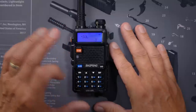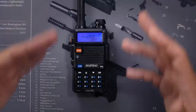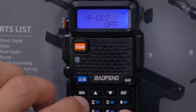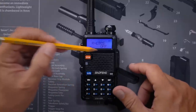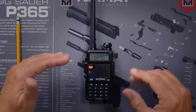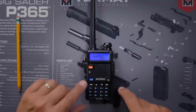The menu option for CTCSS tones is 11 — that is the receiving CTCSS tone, meaning I will be listening for those tones. Receiving DCS tones would be option 10. I'm going to start with CTCSS tones, so I'm going to go to menu option 11. You then hit menu again to allow you to edit that option. And the very important step that was missed by Mr. James C. is that you must set an arbitrary tone — any tone, it doesn't matter. A tone has to be in there or it won't work. It sounds stupid, but that's the way it must be.